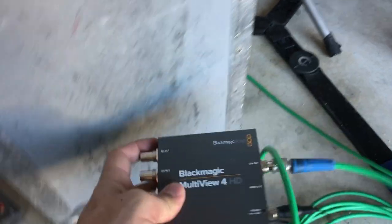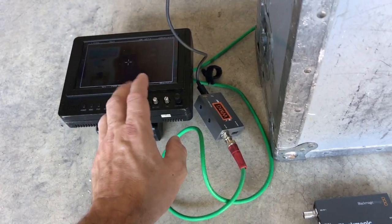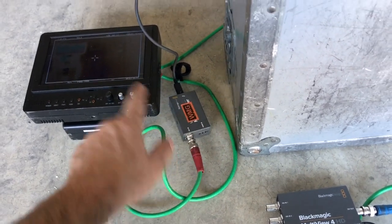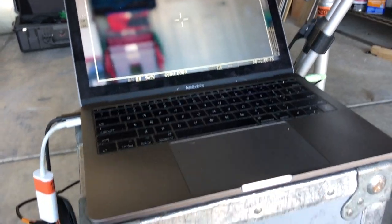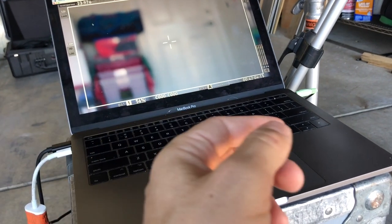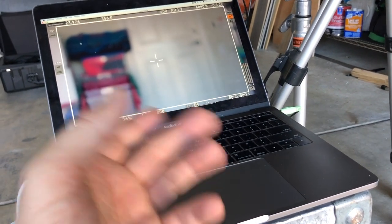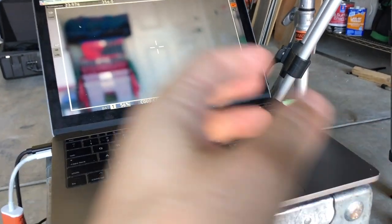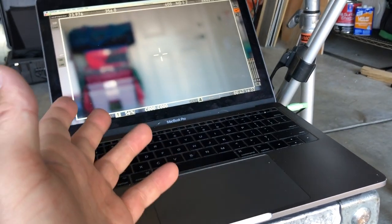However, I can't get this thing to, it sends a quad image to the monitor just fine. And then I go loop out of the monitor into my Blackmagic Ultra Studio, which goes to Thunderbolt to feed the Zoom call. Direct from either camera, various settings. I'm sending 1080, 59.94 right now as the output, even though we're shooting 23.98. But irrespective of all the project settings, output settings in every case, and what I have the software set to for an input, I always get an image.